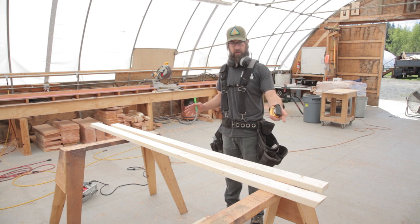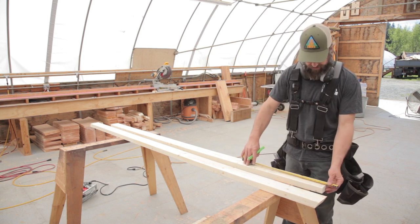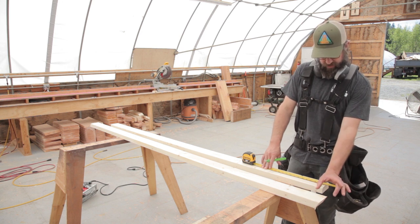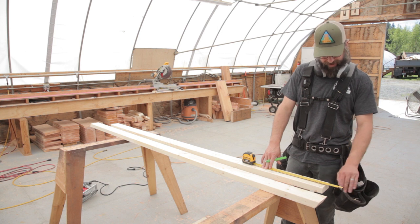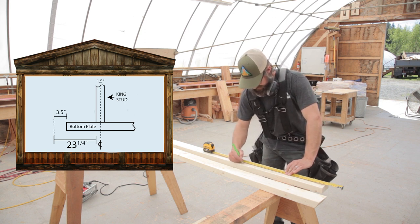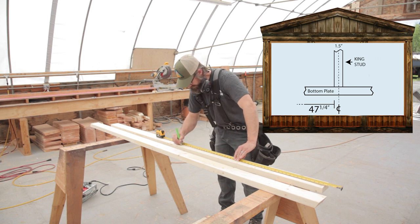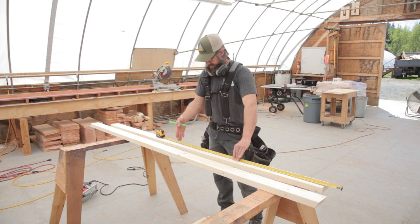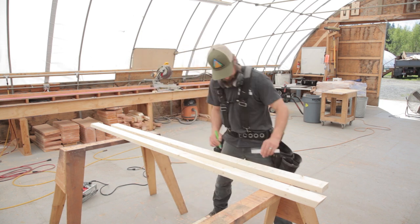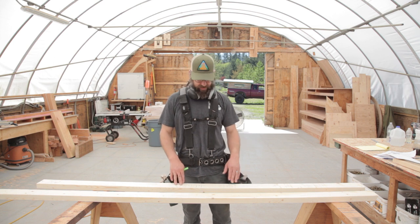Now that the openings are laid out, I'll lay out studs. We're framing on a 2-foot center to keep it light — you could do 16-inch center, but that makes it heavier, and since this is a treehouse let's keep it simple. I set my tape at 3 and a half inches because another wall plate comes there, and I want my plywood to lap. My first mark is at 23 and a quarter so the stud center is at 24 inches, the next at 47 and a quarter so it centers at 48, so my plywood breaks on a stud with a 4-foot panel. Now we'll use these dimensions to lay out the top plate.